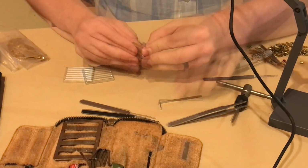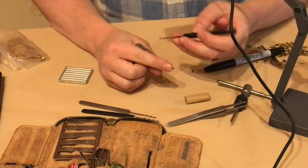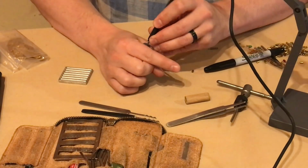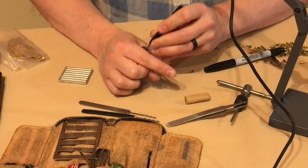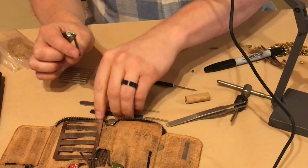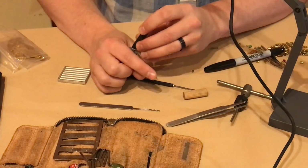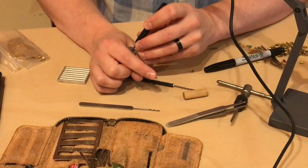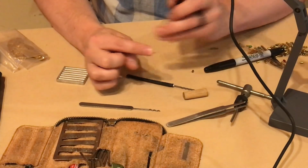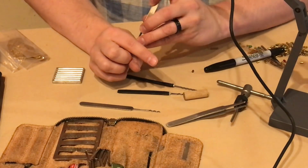So, yeah. So we saw how easily this 3-pin lock opened earlier. Just trying to rake it, not going to be a real positive experience. I can guarantee you that. That's a really long number 2. You saw it. You saw the pins on here. It was a long number 2 pin with some serrations on it. Trying to get the pin behind it is no bueno. I'm locked up on a spool at the moment. I could try to get around that front spool.